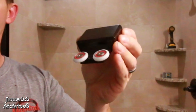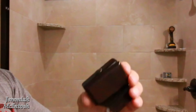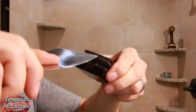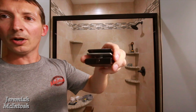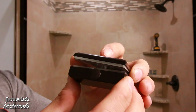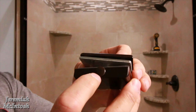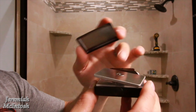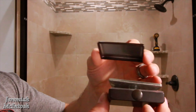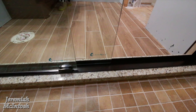When you get to the rollers, to mount them you have to take the cover off the back — there's a screw underneath. That cover is hard to get off at first, but if you put a little putty knife in there and pry it, it'll pop off — there are two little dimples holding the cover on. Once mounted to the glass and hung, you can adjust the doors: loosen the mounting screw and adjust the height. This may be difficult to remove once installed, so don't put the covers back on until your doors are on and fully adjusted.